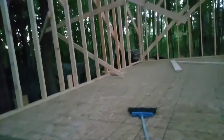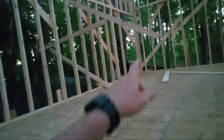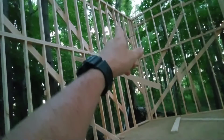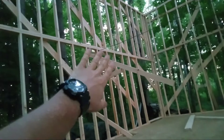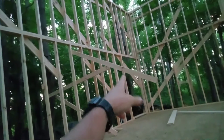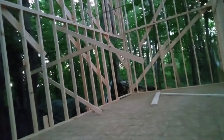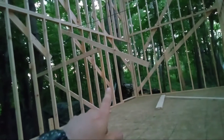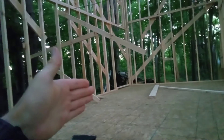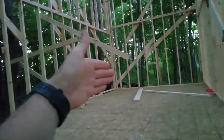I also have to fix my recess here. First I gotta figure out the door opening down there, then cut it, shift this piece to the outside, leave that small corner piece where it is, and use 2x6s as the joining stud — so it'll be one out and then the corner will be in just that little bit.